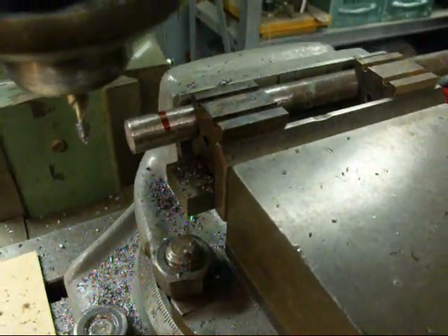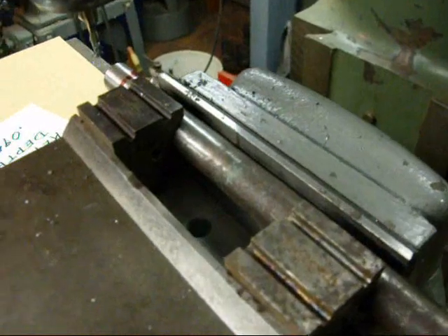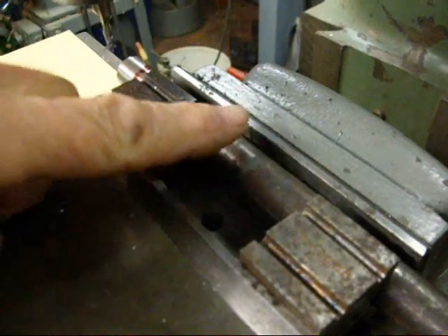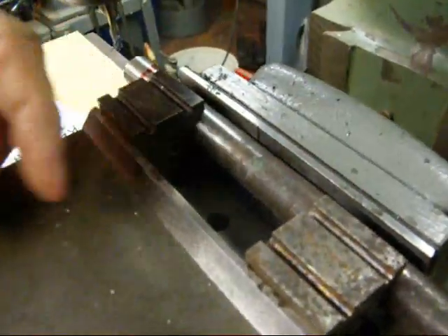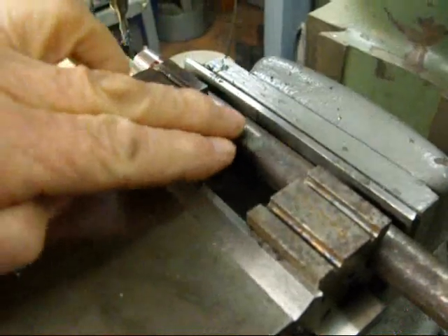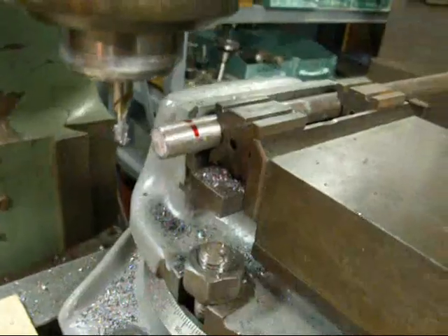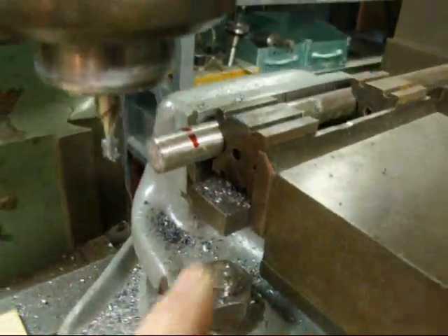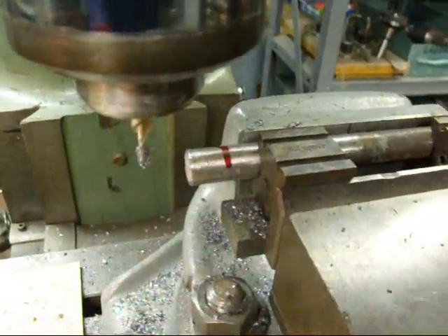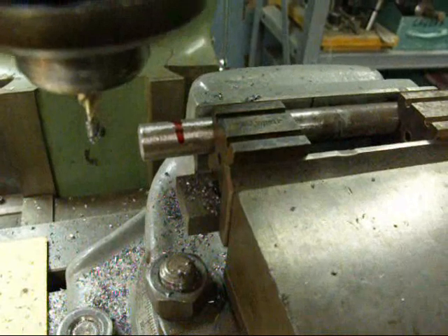It's necessary to find the exact center. Now a couple of things about my setup: it's just good practice to hold your work in a v-block. These are nice steel v-blocks. Notice that I have held the work against the fixed jaw, not against the movable jaw, because we always know that jaw to be more accurate since it can't move. So whenever you're clamping something, clamp it against that. I also have the work set up on a parallel to get the right height, and the last v-block is fairly close to where I'm going to cut — you don't want a large overhang.